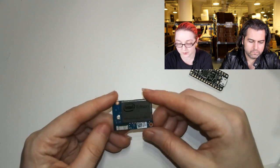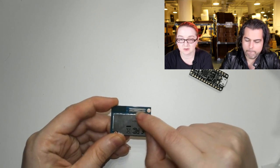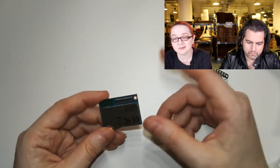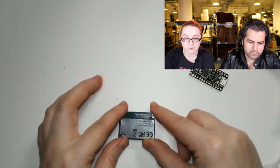It's this all-in-one board. The only thing is that to get to these pins, you have to use this connector, which is a 0.4 millimeter pitch connector. It is too small for mortals to solder. I mean, you can't. I wouldn't suggest hand soldering. Not a good idea, unless you have the right tools.